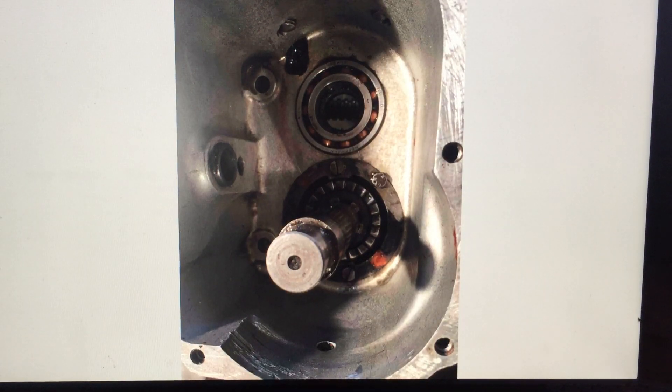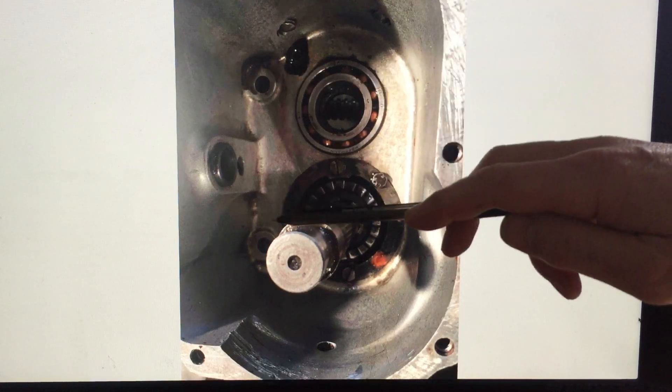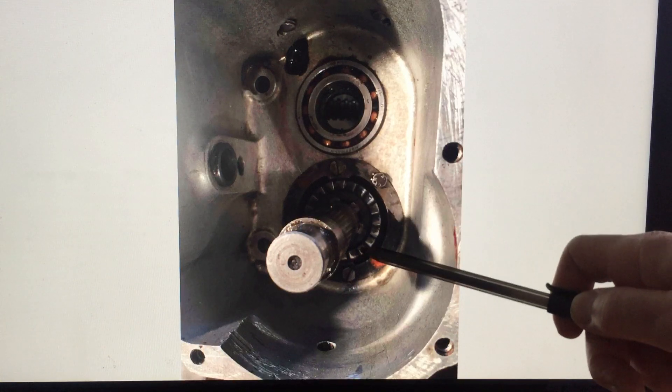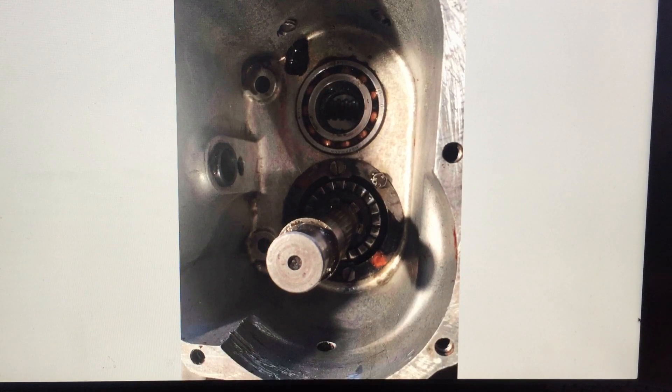To fit the bearing, you just measure the size of the existing bearing and put a new one in. You can try to find the exact size from the Triumph manual, but a lot of these housings and shafts are worn, so it's often better to blueprint everything. I've cleaned the inside as well as I can. You've got two bosses for the shafts that support the gear linkage forks, and there's a ratchet mechanism on the kickstarter so that when you pull it down it drives one way into the mating part on the other side of the gear shaft.